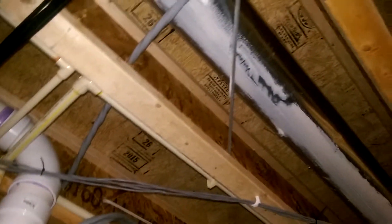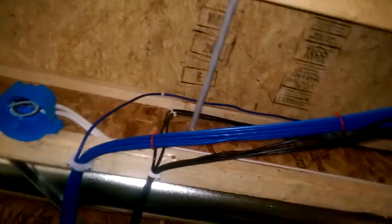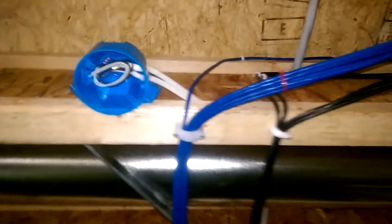There's a big web of cables here, but I've tied all the pairs up together and gave myself plenty of extra space. I've labeled the rooms — the bedrooms and so forth — so they're good to go. I tried my best in certain situations to avoid running near electrical lines — curving around them where needed. Some spots are close but not touching.